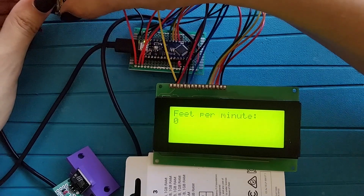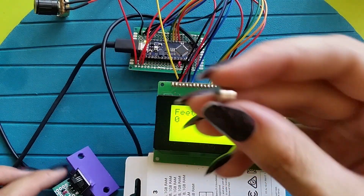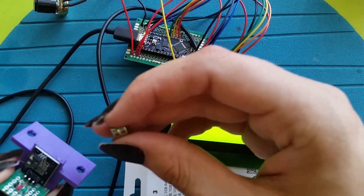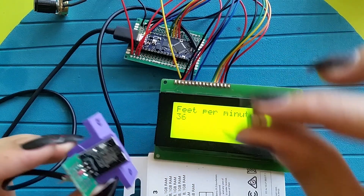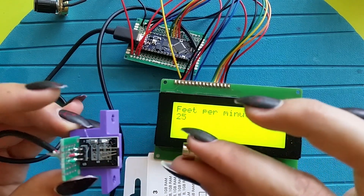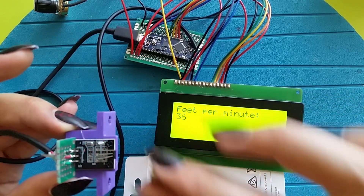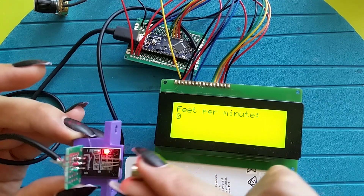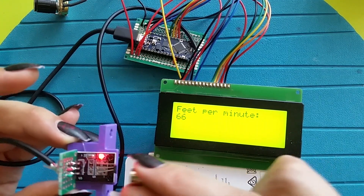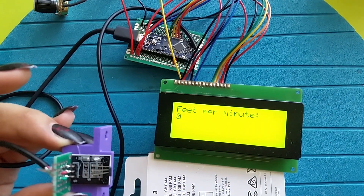Adjusting the contrast a bit — there we go. The device is just waiting to receive a pulse right now. Here are some small magnets — the same type I glued onto the saw. In the correct orientation, when I bring the magnet close, the little indicator light on the board lights up. As I start bringing the magnet close, it starts calculating what it thinks is feet per minute. The faster you move, the higher the number climbs, and if you stop it zeros itself out.